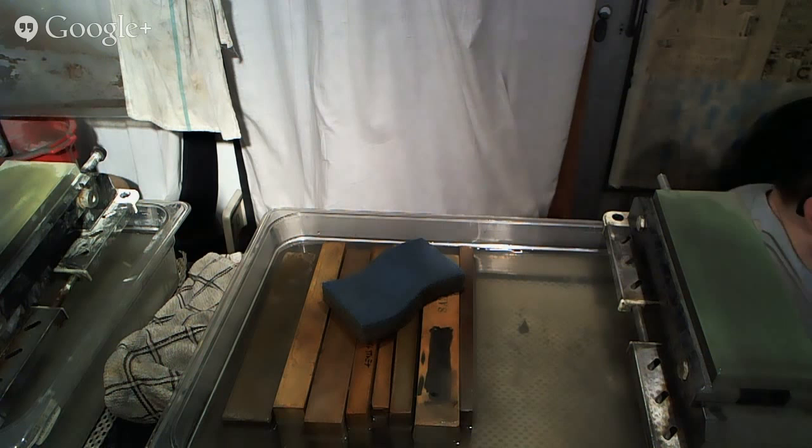We have someone here, Cameron, who asks if I can talk a little bit more about right-handed versus left-handed sharpening on double bevel blades, and I am happy to. Here is the gist of it. Japanese knives are not always ground equally on both sides of the knife, the face of the blade, I mean, not necessarily just the bevel. And the bevel is designed to go in conjunction with that. You'll find that most double bevel knives from Japan, with very few exceptions, can be adjusted for either right or left-handed sharpening, which is an issue of asymmetry more than anything else.